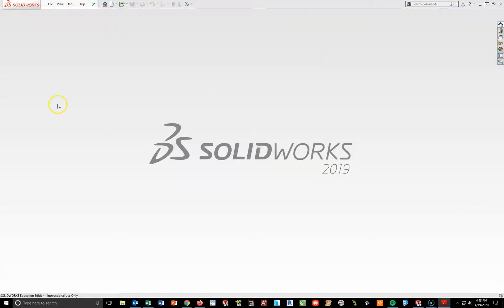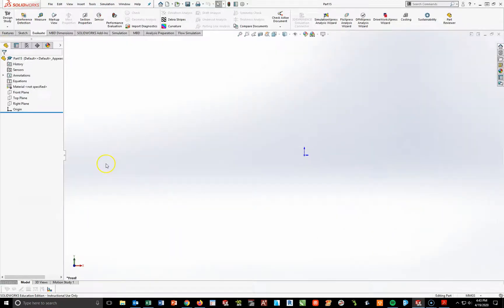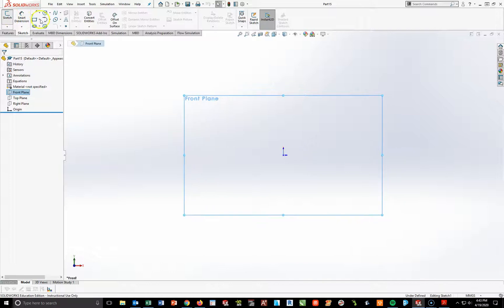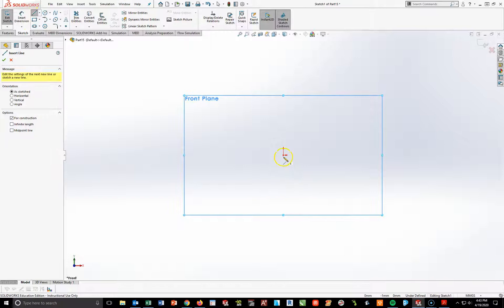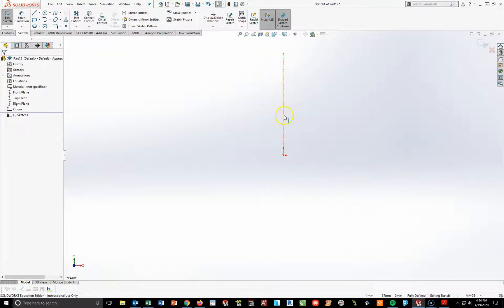This is not an overly complex part. I'm going to start on the front plane, draw a vertical center line, and create the half silhouette of this part, then revolve it around that line. That'll be the first step. This part is metric, so I'm going to go File > New, metric. Starting on the front plane with a new sketch, I'll create a vertical center line — the length does not matter, I just want it vertically straight up and down.